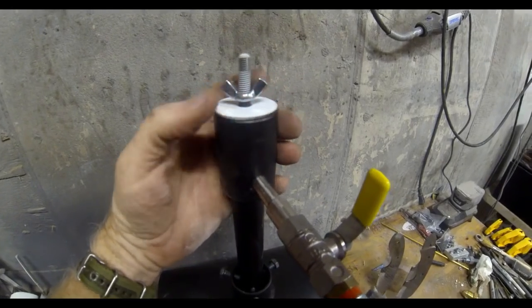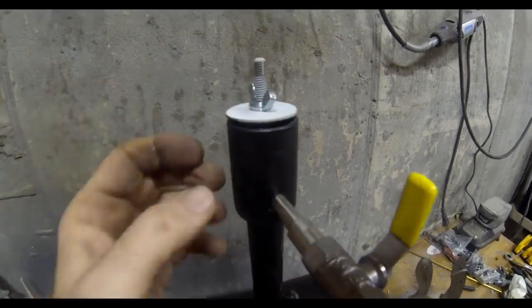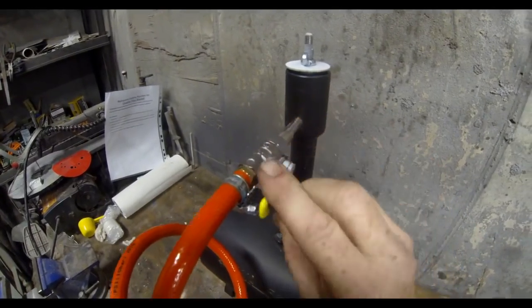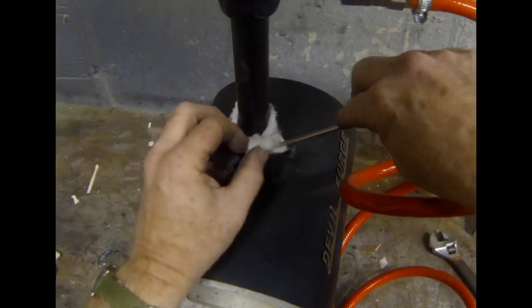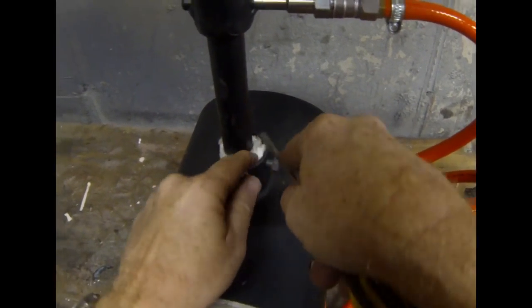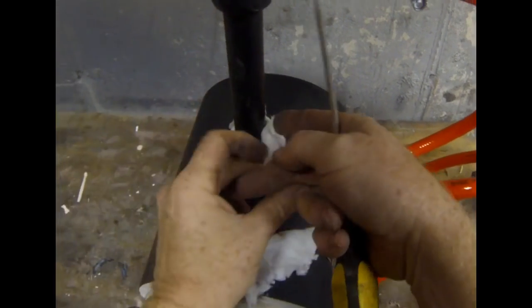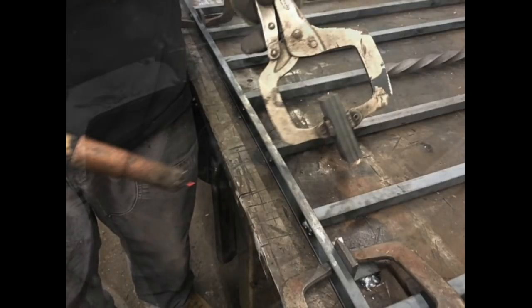At the top of the burner, there's a choke. You always want to have this choke, especially when you're starting out, open just less than 1/4 of an inch. And you'll adjust that once you light the forge so that you get the proper light blue flame. And that's covered in the instruction sheet, which is provided with the forge. The last step in the assembly is just going to be to pack the space between the tube and the burner with insulation, which is provided. I forgot to mention before that all Devil Forges now come with rigidizer, but I'm going to cover the painting of that rigidizer onto the insulation in a separate video.